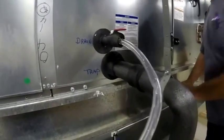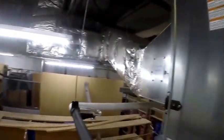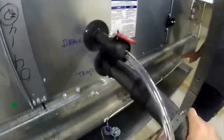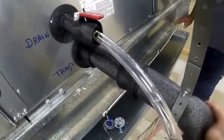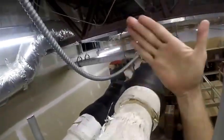While this is draining, I'm going to come down and we're going to restart this unit. The next thing you want to do on these is verify that the economizers work, because now that we've shut off the chilled water for the year, the only cooling this customer has is outdoor air from the roof - free cooling. First thing you have to do is test the freeze stat on this unit to verify that it works. You can see on the drain we've had this draining for a while and we have pretty much no water coming out of this drain anymore - that's what you want.